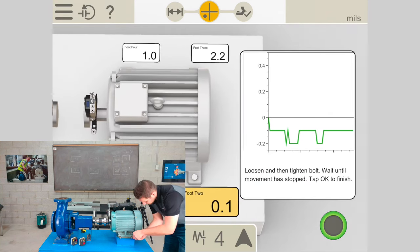I'll do one more measurement using the multipoint method. Click new measurement, switch over to multipoint, take the first reading, and then simply go to different measurement points around the shaft. The results repeat very, very well. All of the measurements I've done using every method have repeated well, so I'm ready to move on to the as-found results screen.